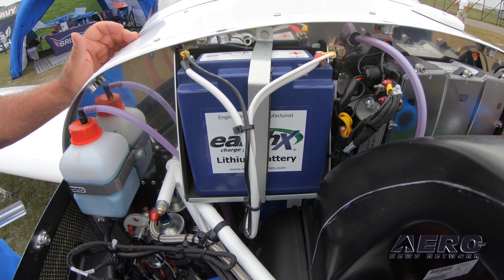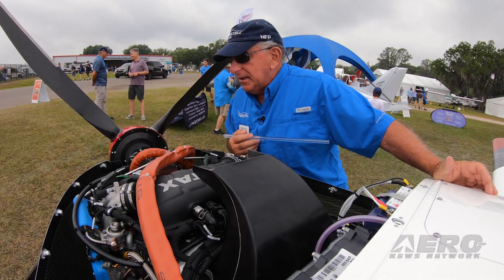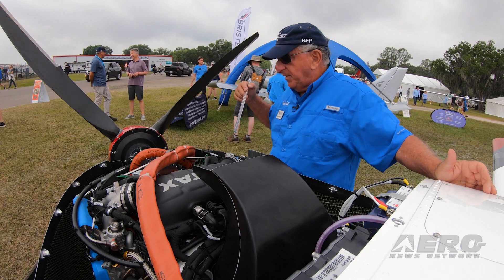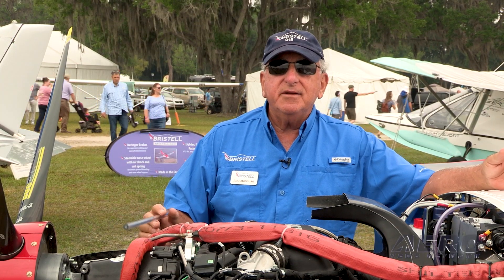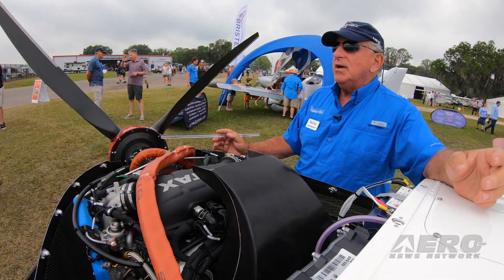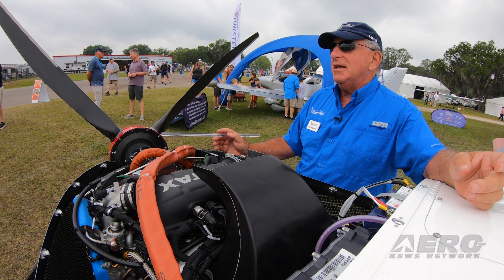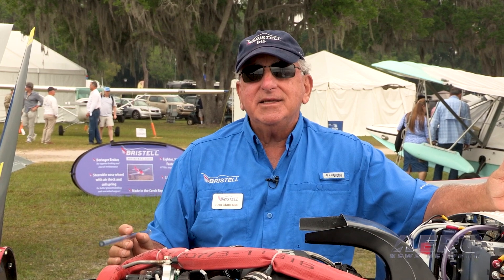We have a special coolant here — a 48 coolant — which helps dissipate heat, different from the standard one. I've flown this plane from Lancaster from 400 feet to 18,000 feet in 12 minutes, averaging 1,500 feet per minute climb. When I got to 18,000 feet, I was indicating 118 knots and had a true airspeed of 160 knots. The plane is certified to 23,000 feet, where we're anticipating true airspeeds of 200 knots up there.